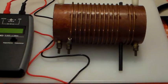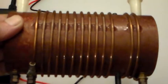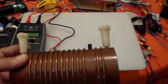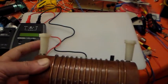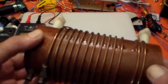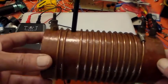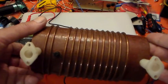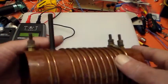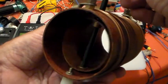Now this is quite interesting. It's got some nice insulators to mount it on - they're not ceramic but they're fine. It's the right sort of diameter. I think this came from a broadcasting installation, part of a broadcast transmitter maybe. It's quite interesting in that it's got a shorted turn inside it to adjust the inductance. I've never seen that before.